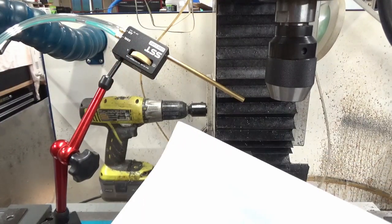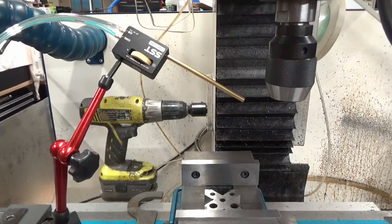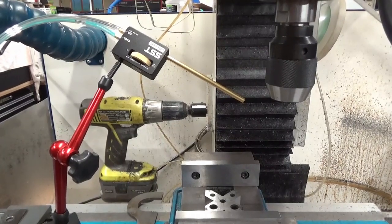Luckily this coolant is actually pretty nice smelling. It's kind of a strange brand, has no specifics on ratio or anything like that, although they say the maximum ratio is 53%. I did it at a 3-to-1. So looks like that'll be pretty good. So I'm excited now to try cutting something on the mill and try this out. Anyway, I'll let you know how it goes, and I'm sure you'll be seeing this a lot in future videos. Thanks a lot, and take care.